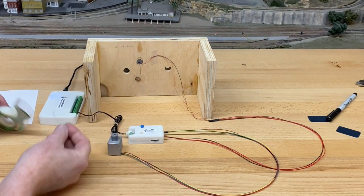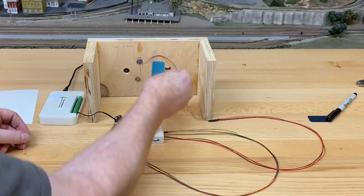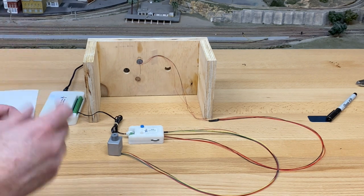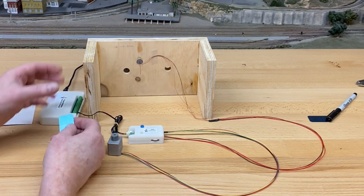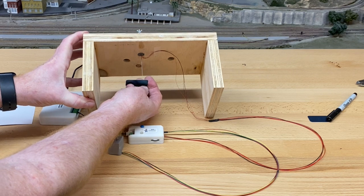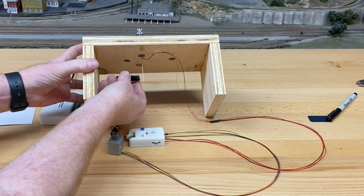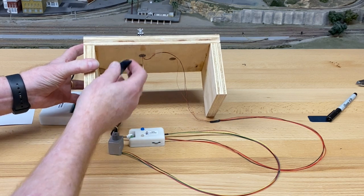Okay, so that's what it's going to come with, and you're going to just be able to put the metal pad in, put the motor on, and pretty good chance it's going to be very close to the 1-inch setting, and we've pre-bent the wire. In this case, the wire is for a case where maybe you have to have the wire remotely further away. Maybe you have a lot of foam or scenery, and so your platform might be down here, and we give you this extra length of wire, and we're going to show you how you set it up and bend it.